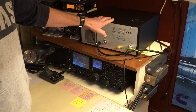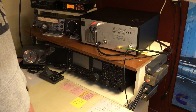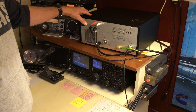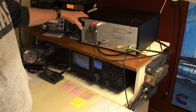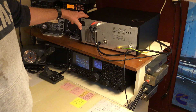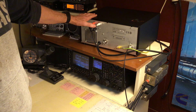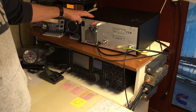Solid state versus tubes — I went with the tube amplifier because they're just simple. Simplicity. Last forever. And they're bulletproof. I've got very close proximity antennas, so that's something to keep in mind if you're looking at a solid state, because I know they're a little bit susceptible to RF getting in them and hot switching. So far so good — I've never had any trouble with a tube amplifier. They're just simple. They work. Trouble free.